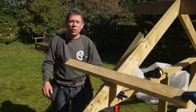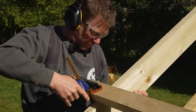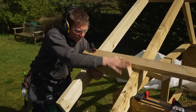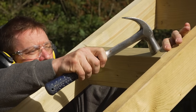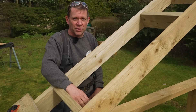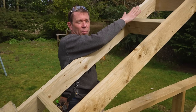Here we are on our rig again and a lot of people ask to see a gable end ladder. This is the more standard way of doing a ladder. These noggins coming out will be at every 400 or 600 centres, and then when you've got the cavity, the brickwork will be built up and support them nicely to stop any sag.